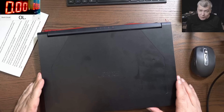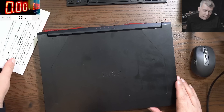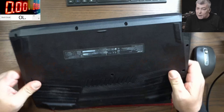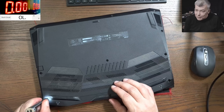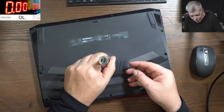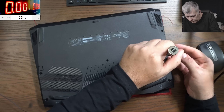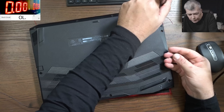I'm about to carry out detective work on this laptop and try to fix it. The customer is saying he was able to check the power getting to the first MOSFET but not after. This is saying a lot — it means the input power circuit is disconnecting the power because most likely the main power rail is shorted. If it's shorted by a dead GPU MOSFET, we can still disable the GPU and the customer can have a working laptop on Intel graphics. If the shorted MOSFET is on the CPU, then it's end of story.